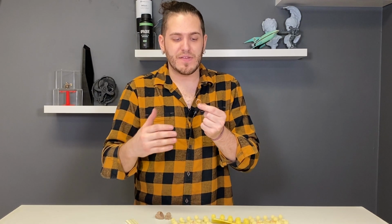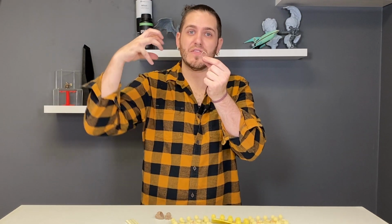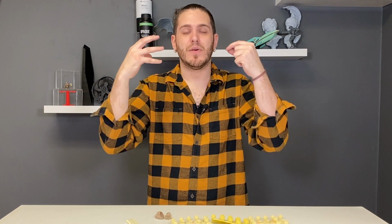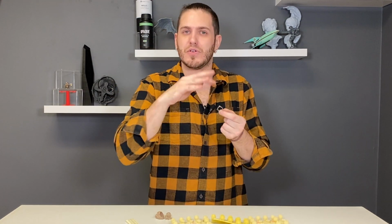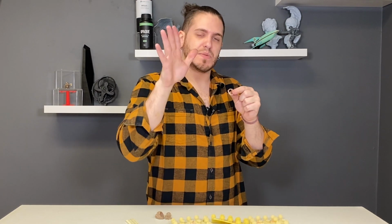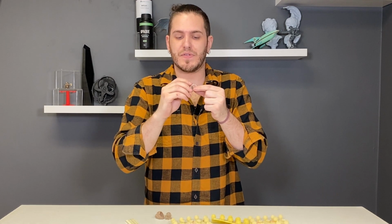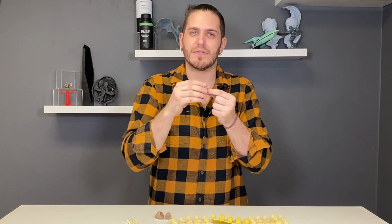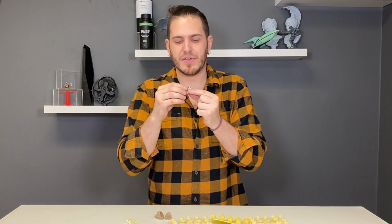My theory is that when the metal is at its hottest, you want it to be hitting all the small details so it has the most chance to fill in all the little prongs and things. The pave ring, aside from the stone settings, which I believe was my fault, turns out great, with very smooth sides and no surface texture except for where I had some support holes, but nothing major.